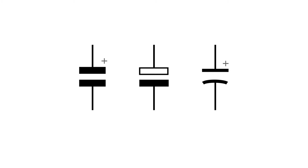As a starting point, let's look at the circuit symbol. Here we see the normal circuit symbol for a capacitor and we see it is not polarized. Sometimes a positive sign may be added to this circuit symbol for an electrolytic to show that it's polarized, but more often this symbol is used, and this one may also be seen. The capacitor needs to be connected the right way round, with positive on one end and negative on the other.